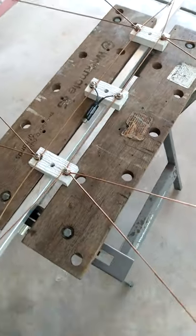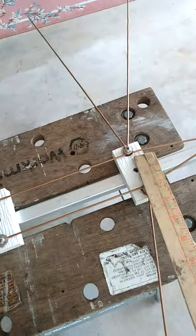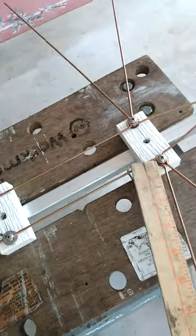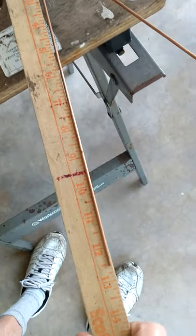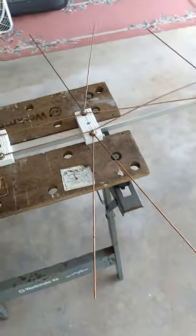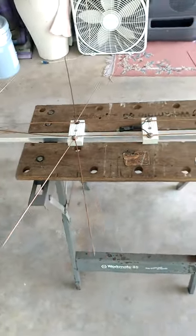The copper I used is number 10. On the inner bows — here's the feed point, here's the top inner bow, here's the bottom inner bow — the inner bows measure 12.5 inches. That's a big bow. There are four of them.